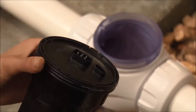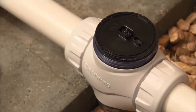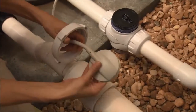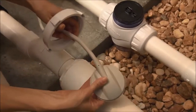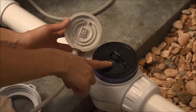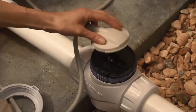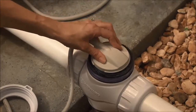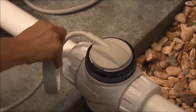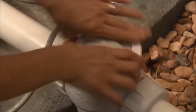Verify that the o-ring is attached and positioned at the top of the cell. Place the cell into the vessel. Push the cell cap and attached cable through the retaining nut. The cell cap contains a key that corresponds to a slot on the cell itself — the key will automatically align with the slot when the cap is placed on the cell. Place the cell cap on the cell and secure the cap to the vessel with the retaining nut. Hand tighten only.